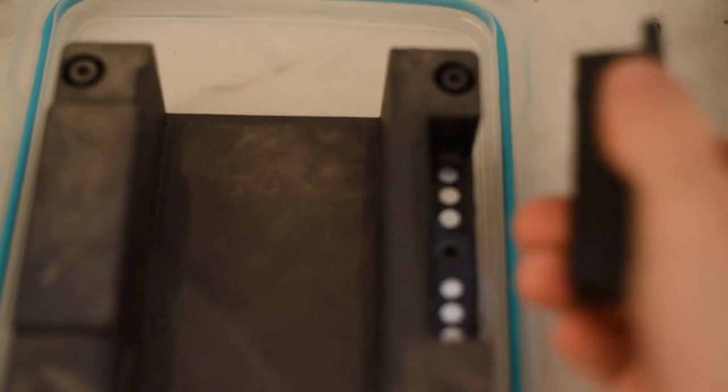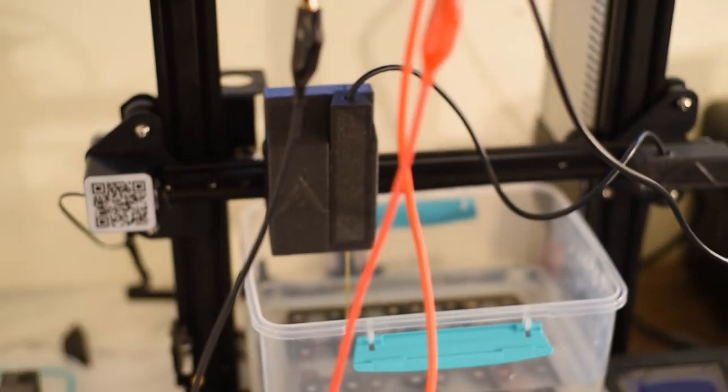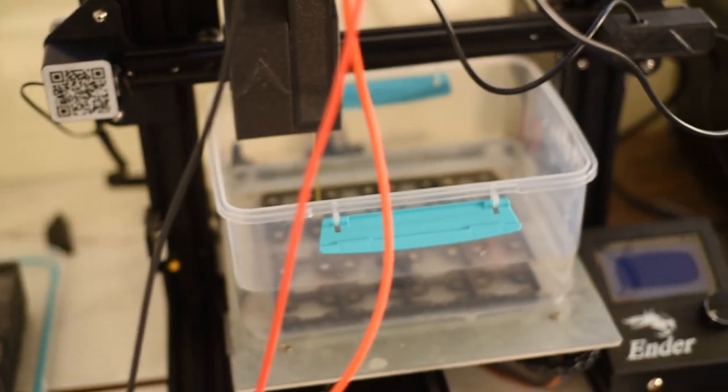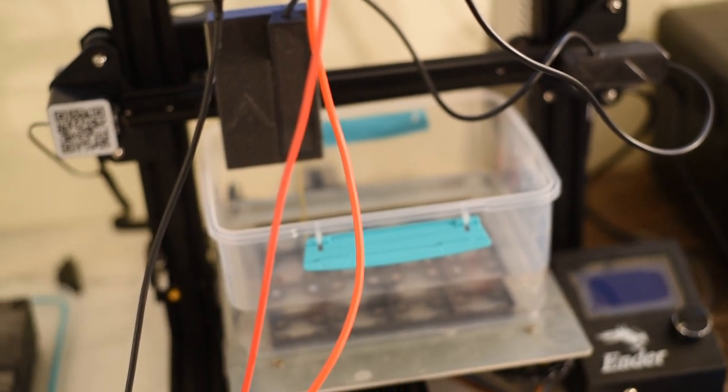This is also magnetized. Quite nice. It supports flushing of the work and holding sheet stock down. And basically, we're going to try and use this thing to cut a through hole in a ceramic glow plug through silicon nitride. Maybe we'll be able to do a direct thermal approach this way, and it would greatly simplify everything and make the whole Rotoforge situation much quieter as well if it does work.